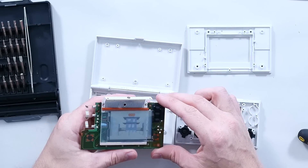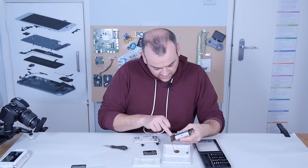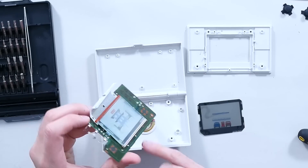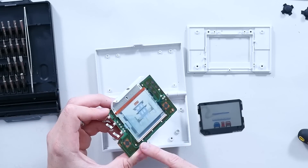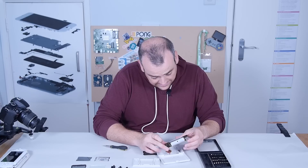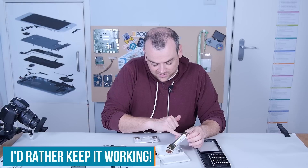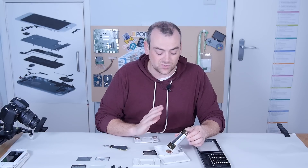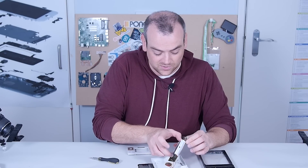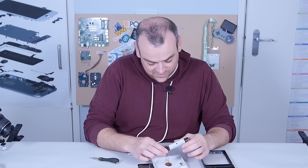Different method of assembly here — the backdrop and mirror have already slid out. All the function buttons up top are membrane buttons, all just conductive coating on the rubber, same for every single button. There's a conductive rubberized strip at the back pressing the contacts at the bottom of the screen. I really don't want to force this LCD screen off its contacts — I'm not sure I'd ever get the alignment right again, and I'm worried I'd damage it trying. I hope people are with me on that decision.